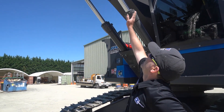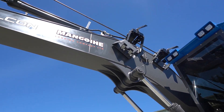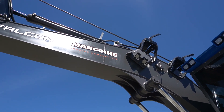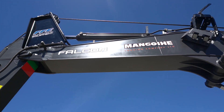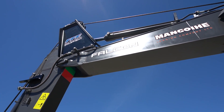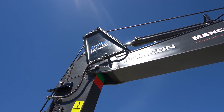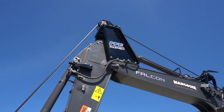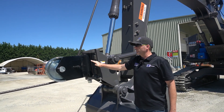Following on from the rear of the machine, we come around to the boom. As you can see above me, we've fitted our boom rollers. The bullhorns are currently folded down for transport. We move on forward to the end of the boom where our fair lead is mounted up there. Included in that unit is a load pin and encoder for measuring the rope.